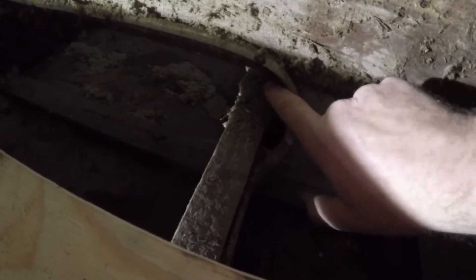You'll see over here that we've actually got quite a gap here — I can stick my whole finger underneath here. If I put this LVL up here, you can see the gap. What's happened is that the ceiling joists are running through, the weight of them are going down and they haven't been pushed up against this hanging beam whatsoever. And the ceiling itself has actually got a bit of a cup in it.